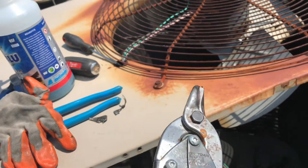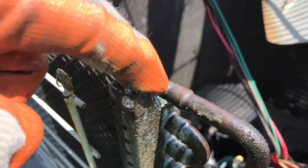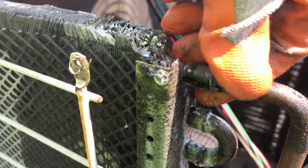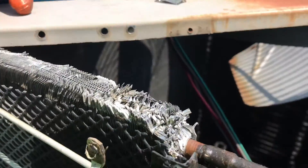I'm using my Bulldog Tin Snip. The metal's a little thick, so the regular tin snip might not work that well for you. I snipped out the metal around the pipe and cut it into a couple pieces — you can see it there — just to give me full exposure of the pipe all the way around so I can make sure I get enough braze on there to fix wherever the leak is.